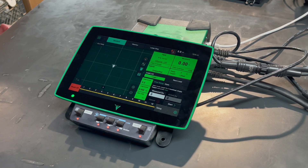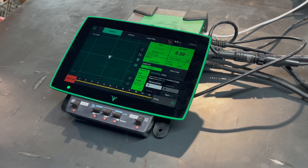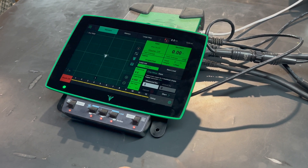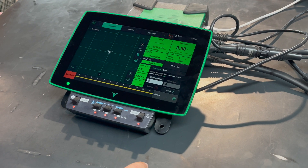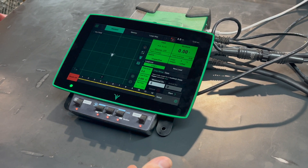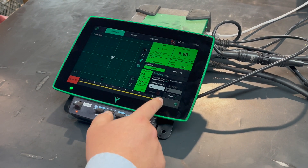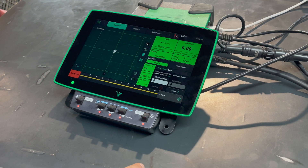To complete the crop setup for the calibration of the mass flow sensor, the best practice is to go in on your first field of the season, open up the field, and when you get to the point where you can have everything empty — allowing the natural flow of material out of the combine as well as out of the cart so that no one has to get into either tank — make sure everything is onto that truck, then hit the start button and continue combining.